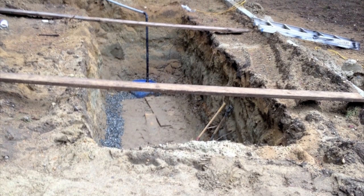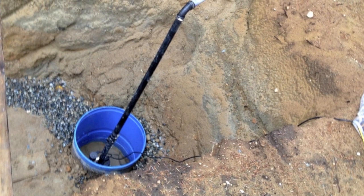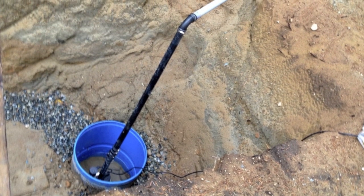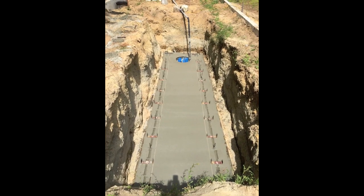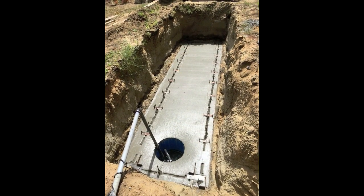So then I rented a small excavator to tackle the main feature: a 20-foot long pit, five feet deep. At that depth, a lot of water appears during rainy season, so we needed a dedicated sump pump and chamber. Next was to pump in the concrete for the pit floor and try my hand at floating concrete, which turned out just fine for a pit.